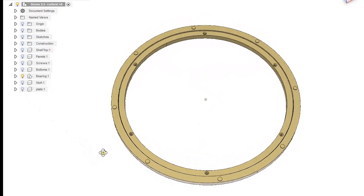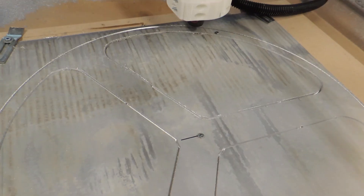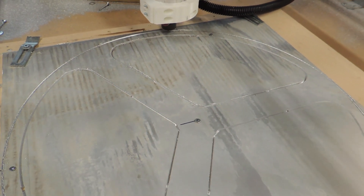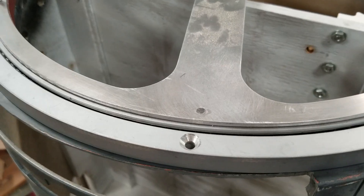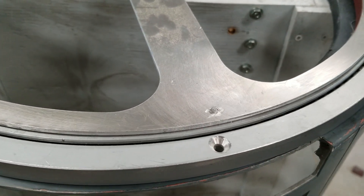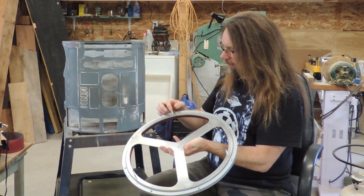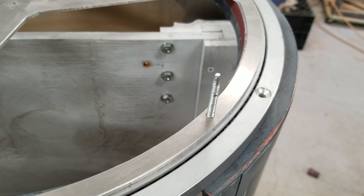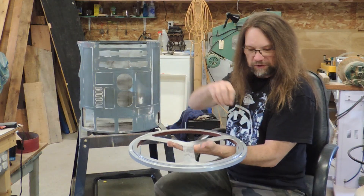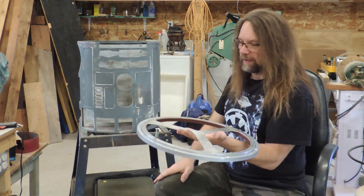The plate was modeled in Fusion to sit on top of the Rockler with holes centered on the existing mounting holes. This was then exported to my CNC router to be cut from three millimeter aluminum plate. I tapped these holes for number 10 screws which fasten the plate directly to the bearing. I left three of the six mounting screws long and they passed through the plate, and the dome has corresponding holes which just slipped right down over these studs — that's all that holds the dome in place for now.